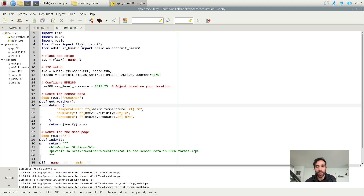These imports allow us to interact with the BME280 and show the readings in our web server. We also have board and busio, which allow us to do the I2C communication with the BME280. First things first in this code, we are starting that Flask app, followed by setting up the I2C communication.